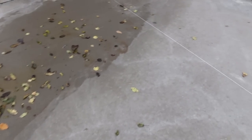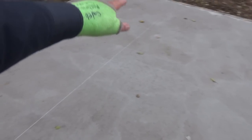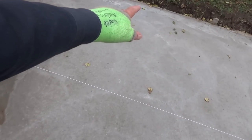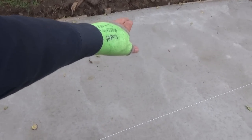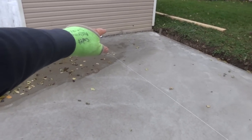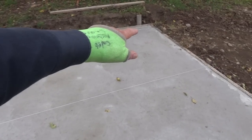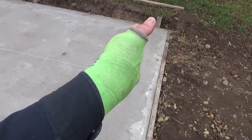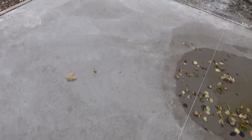We've got another line here - basically just tied, looped, and over. I did eight feet, eight, eight, and then the rest. Eight should be plenty. Over here from this corner: eight feet, another eight feet, and then eight feet, eight feet. We're pretty close from this end to this end for the same distance, but this way didn't come out right - I've got under 24 feet here. We're a bit short in this corner, and I think this form tilted on me a little bit. Can't do anything about it now. So I've got to saw cut this - one, two, three, four cuts - and that should give it lots of flexibility.